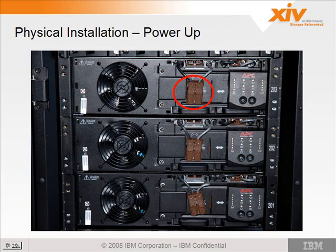Okay. All right, so don't plug into the back of the UPS, but on the ATS there's going to be the same jack. So plug into the ATS instead of the UPS. Yes, you have access to ports on the ATS that you could use. So the comment for the recording was, it's not advisable to plug into the UPS because you have the chance of disturbing the cabling or unplugging or flipping a power breaker. So if you want to power your laptop at the machine, use the port on the ATS.